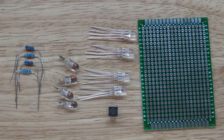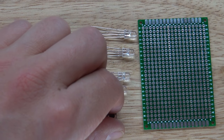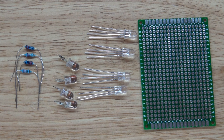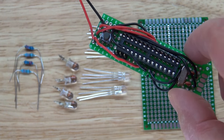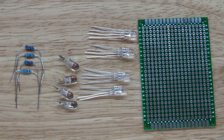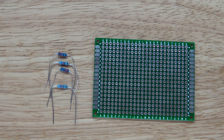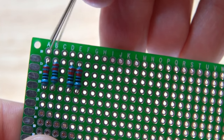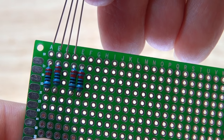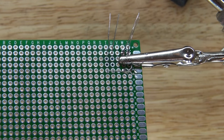Now let's get started on the electronics part. In a previous video I showed you how to make an Arduino on a perf board, and I've already done that — so if you want to see that video, click on the link in the description or the info card at the top of the screen. Now let's get started with the LED parts. I'm going to start with these resistors and solder them into this perf board, so that you can add resistance to all the anodes of the RGB LED, since this is a common cathode RGB LED.